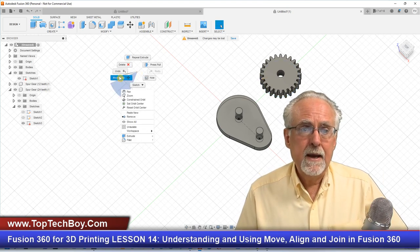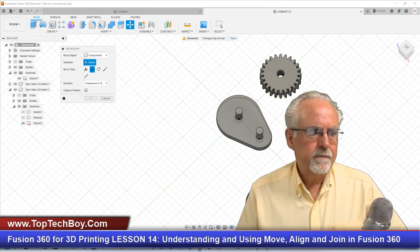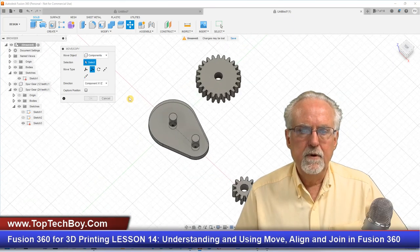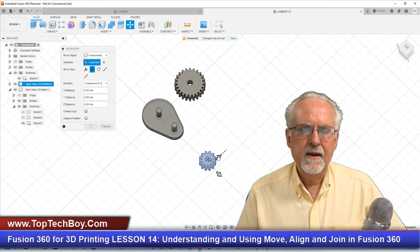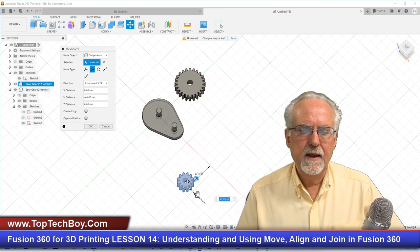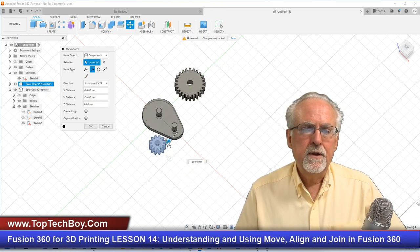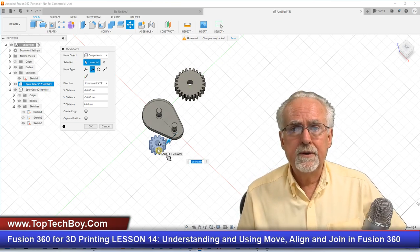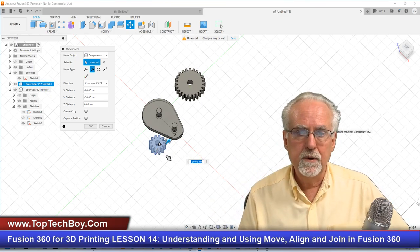So I would right mouse click. I would say move. Move component is okay. I am going to choose this component, and then I'm going to grab, I think this is the Y slider, and put it here, and then the X slider is here, and I'm being very careful to not touch the Z. Why do I not want to touch the Z? Because I want to keep it against the build plate in order to build it.